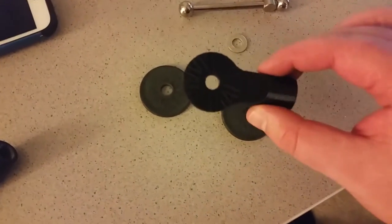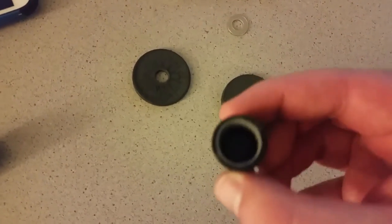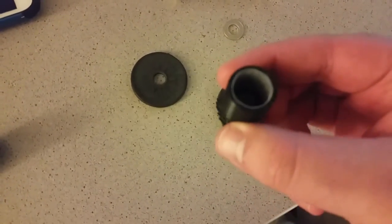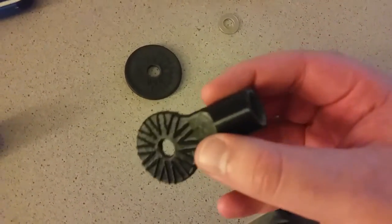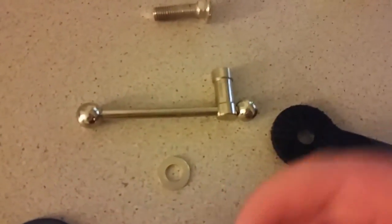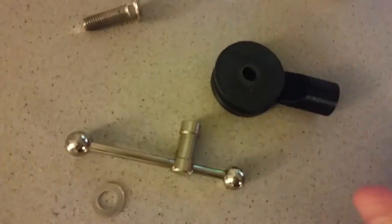So the print finished and it looks like it came out really well. I was able to duplicate it pretty spot on, even with all these little ridges and stuff, because I think it uses that to grip. Obviously I don't have the threads on it — I tried to screw it on a little bit, so I'm just going to try and self-tap it. It looks like the way it attaches is it has these two rubber stoppers, and this goes in the middle of those two rubber stoppers. Then this bolt goes through it, and this screws onto the bolt so I can turn it and loosen it.